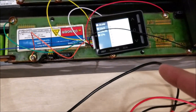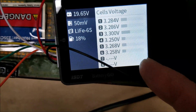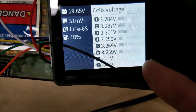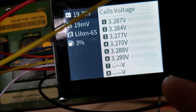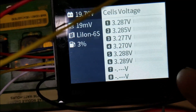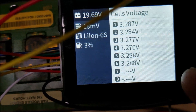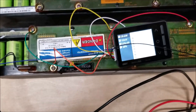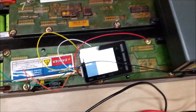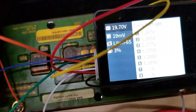For now we're just going to test this one battery pack. If you look at the voltage, you'll see it varies a bit. The lowest on this one is 3.25 and the highest is 3.30. Over here the lowest is 3.27 and the highest is 3.289. This is not ideal for balancing — we'll probably end up with some imbalance between the two halves, but I can charge whichever group is lower. There's 50 millivolts of imbalance on one and only 19 millivolts on the other.